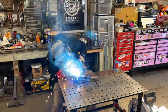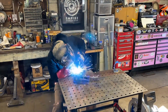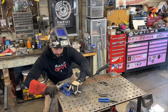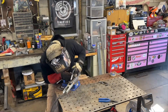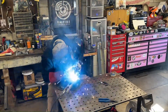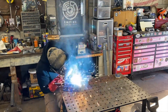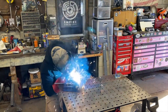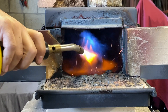Let's get it welded up and thrown in the forge. As I start to weld up this billet, it's worth mentioning that you want to weld it completely all the way around on all sides, totally eliminating the chance of oxygen getting in between the layers. With stainless steel in particular it requires the presence of a vacuum — we need a guaranteed zero percent chance of oxygen between the layers. Even then the forge weld is difficult with a pretty high rate of failure, and it requires a much higher forge welding heat, so we're going to be really patient with it in the forge.